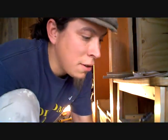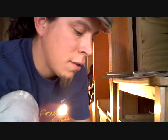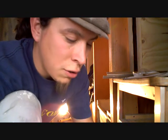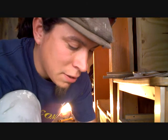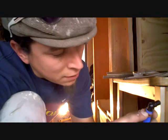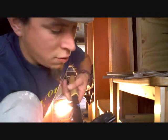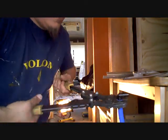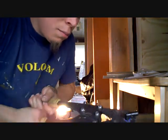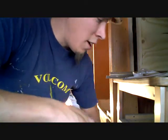A lot simpler. First things first, you slip on your PEX ring over the desired amount of hose. Push in your connector piece till it stops. I go about an eighth or so, maybe an eighth and a sixteenth away from the edge. Lock in your clamp device and snap. It's that simple. Bam. Now it's on there and it's not coming off.